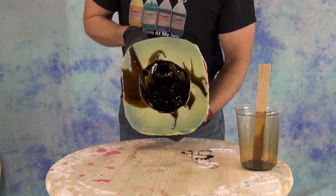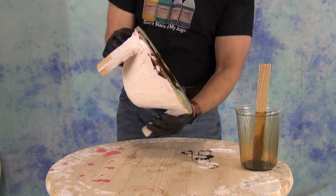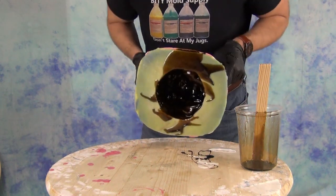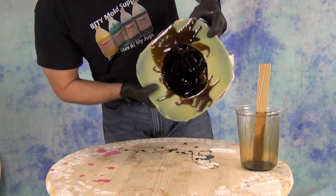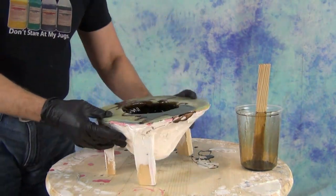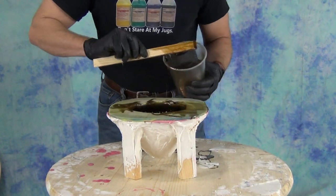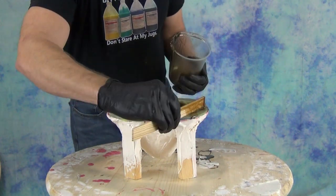This particular resin formula has about a three-minute working time, so we have plenty of time to get it accurately mixed, poured into the mold, and carefully sloshed around the inside. One of the nice things about this resin formula versus lower viscosity resins is that we don't want anything too thin — if it's really low viscosity like EasyFlow 60, it's going to sink to the lowest point and not form a membrane around the surface of the mold. You need a resin that clings to the surface, and higher viscosity resins do that better. EasyFlow 120 or TC-800 are also both really good selections for this.